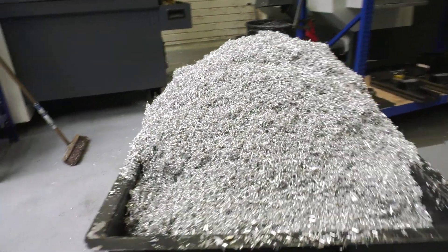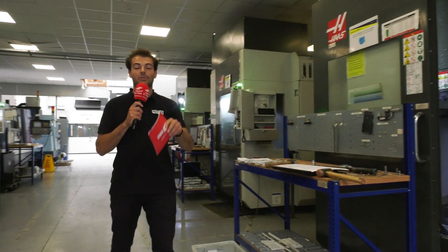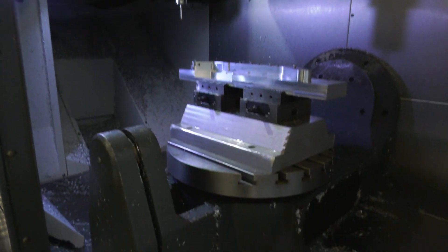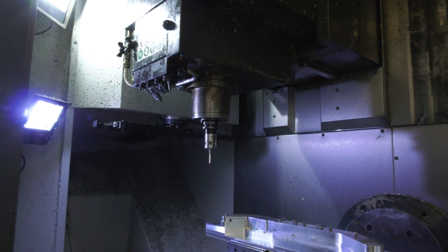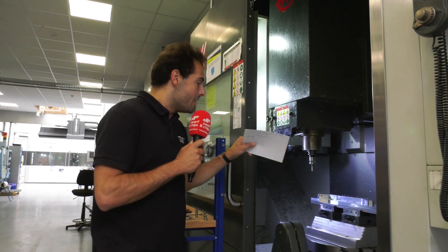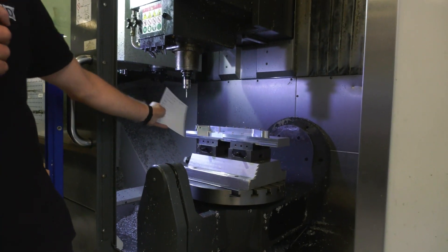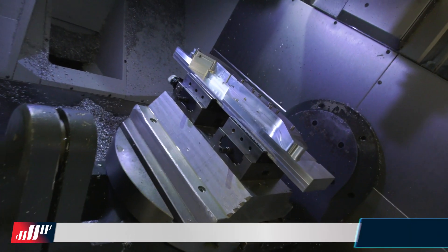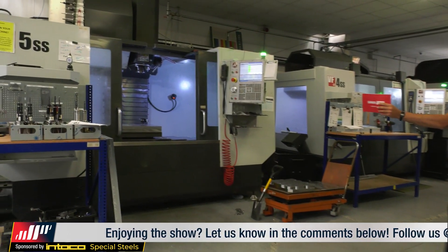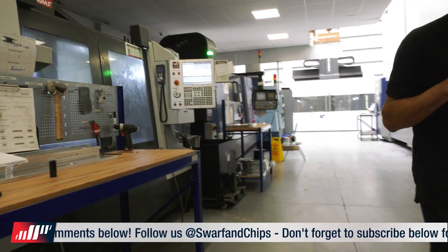These are beautiful brackets for aerospace — look at the amount of swarf these guys are making, it's absolutely crazy. They've got loads of different five-axis machines, but they started off with a Haas VF2. It's a vertical milling machine, but they put a rotary table on it, and that was their first foray into five-axis — and they absolutely loved it. A VF2 with a rotary table didn't quite have the right capacity for everything, so they invested in the Haas UMC 5X 750, with a 750mm cube machining envelope. They loved them so much they now have seven of these, plus VMCs — a couple of Haases and a Doosan.